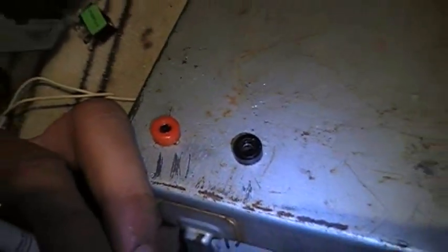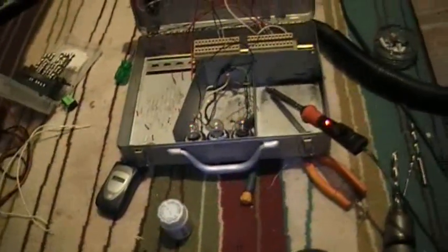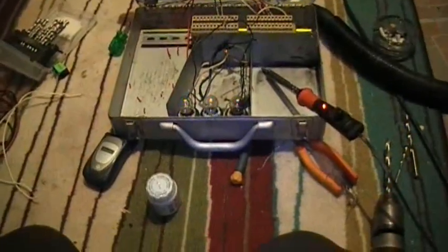There you go — two switches, switch over there. And that's banana plugs, female banana plugs. Basically this is going to be a mystery discharger. I tested the amps between these three bulbs — it's roughly five, five and a half amps. I'll get a better reading when I charge my LiPos to full.